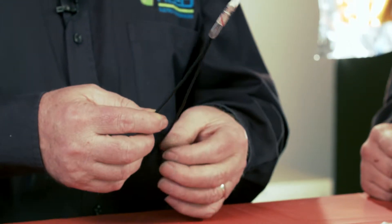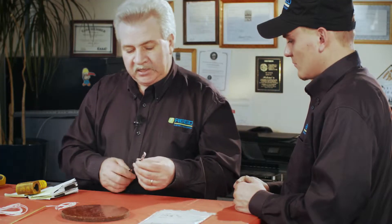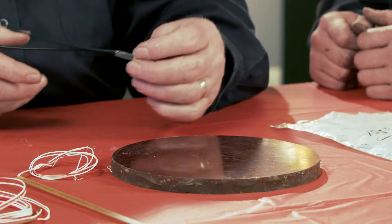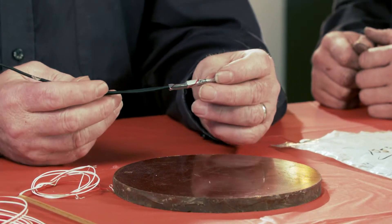So there's a circuit that goes through here unless we heat this up. These are rated for a specific temperature to open at. In this case, where we rewind a stator with class F insulation, that's 155 degrees Celsius. This particular thermal protector is rated at 145 degrees Celsius.